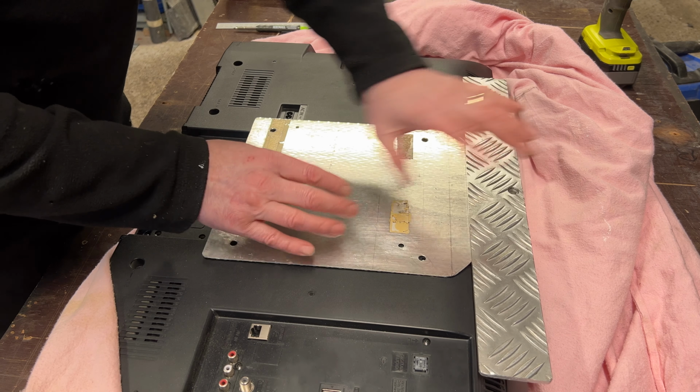I've got to be careful I don't rock the table saw, because all I'm looking to do is zero this relative to the saw blade. It doesn't matter if this table saw bed is at an angle, if the floor's off, for instance. It's a relativity between this deck and the blade. So 0 degrees. Stick this on the blade, it's magnetic, all lovely. And we'll go 45 degrees.